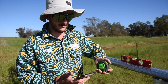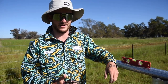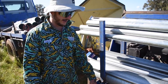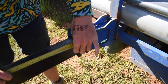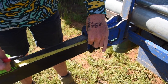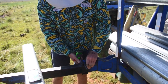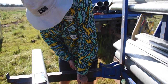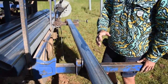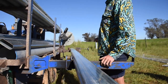That gives us 143.333mm. We go over to the cutting deck and measure that so we can get our distance on the stopper and get our angles right. This is the back end of our cutting deck — this is the stopper. We set it to 143.3mm, make a little mark, slide it up, and lock it in. As you can see it's on the angle, so if we measured it right and done all the maths right, once we make our cuts it should slot in there nicely.